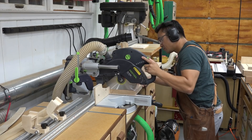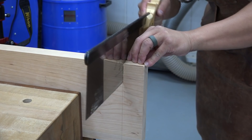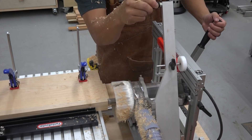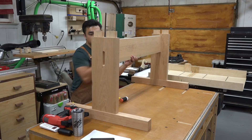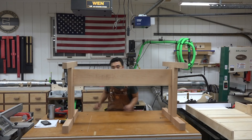After milling the stretcher, I cross cut it to final length on the miter saw. I used a marking gauge to scribe the shoulder on the tenon. The final shape of the stretcher will be an arc, so I removed a chunk of the tenon shoulder with a back saw to leave less material for the pantorouter. With proper workpiece support, I clamped the stretcher to the table and machined the 1-inch thick tenon. With the dry fit, the through tenon is about an eighth of an inch proud of the leg post — I'll be wedging and pillowing it, similar to the through tenons on the dining chairs.